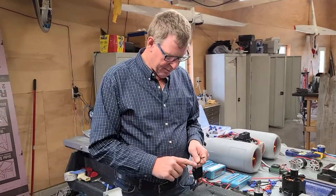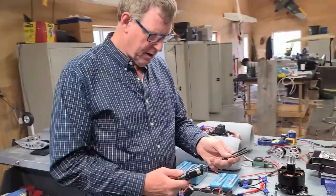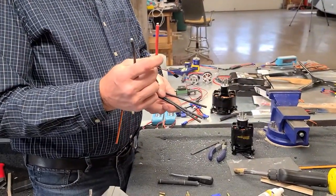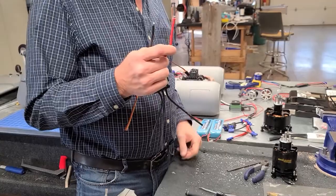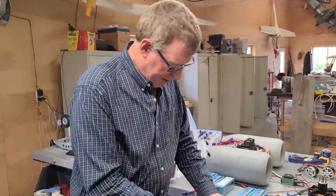So I'm going to remove this insulation off of here and desolder these couplings off of here, and that'll leave me with wires that look more like that, that are pre-leaded. You can see this is not coming off or fraying because somebody went through and pre-leaded those wires for us. Rather nice thing. Okay, I'm going to go ahead and do that then.